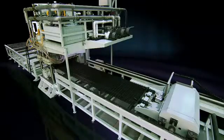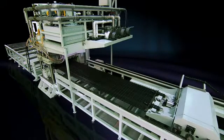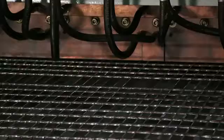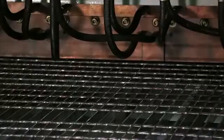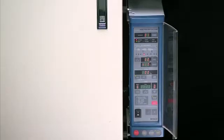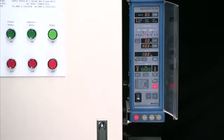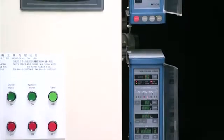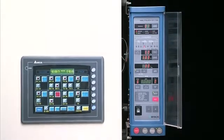The 1500 KVA offers highly consistent and rapid three-phase workpiece projection welding. Each transformer boasts 20 projections at a single stroke, and the machine takes six to eight minutes to complete a full 1x6 meter grating. The Miyachi controller provides primary and secondary current feedback control and primary voltage fluctuation compensation control for reliable welds.